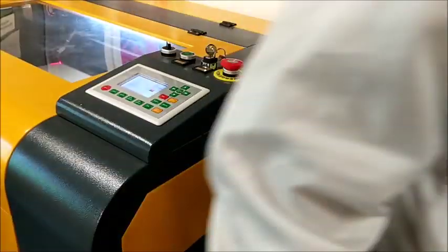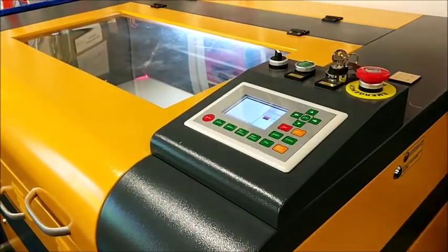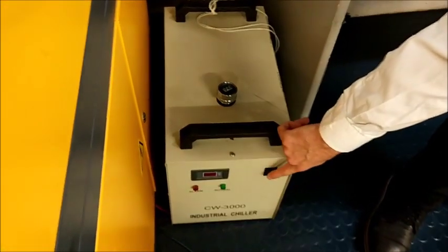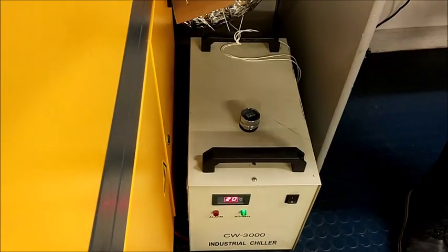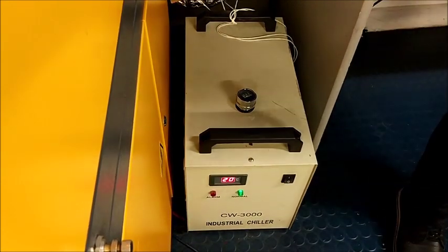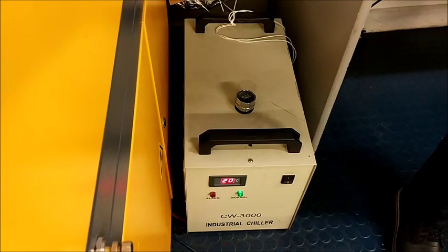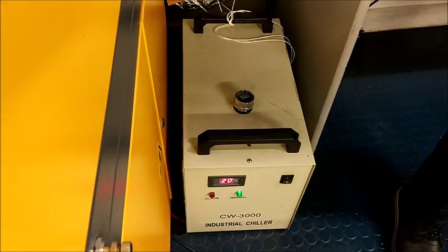Okay. Now in terms of cutting, before we're ready to go, we've got to do a couple of last things which are to do with health and safety. Number one, we turn our chiller on. If your laser machine has a chiller, this has to be turned on, because what it does is it cools the laser module which is in the laser. If you don't turn the chiller on, it might mean that the laser will break effectively, or it will have a cutout that basically says, I'm not going to cut if the chiller's not on,